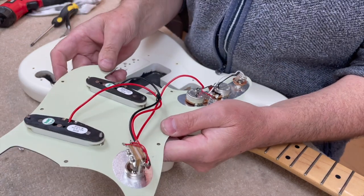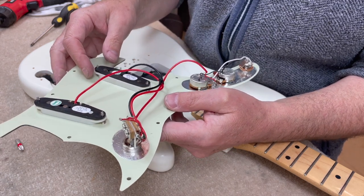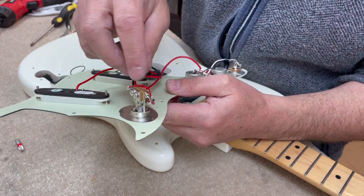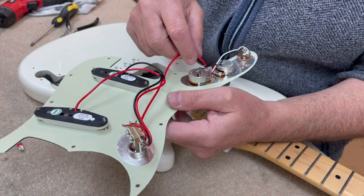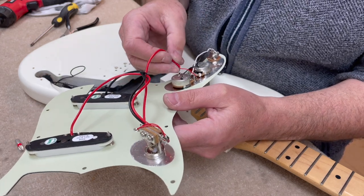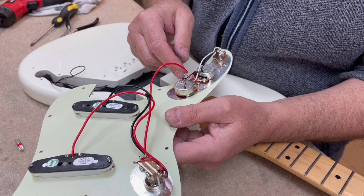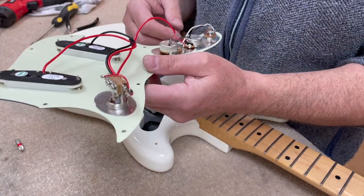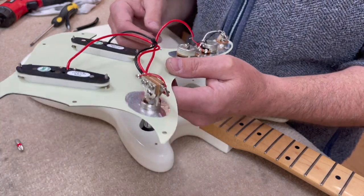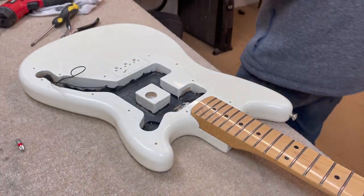Okay, so we're going to replace this one with the humbucker. The way this is arranged is that both pickups go to the switch, out of the switch, back through one of these wires here. This one, did I cut? I must have cut that. That's not clever. Note to self, reattach that one. Comes back to there. Oh, this is the output, to there. Cross to the tone, output to the switch, fine. Yep, so we're going to hook up the Seymour Duncan. I'll do that over here.